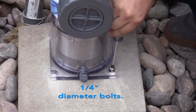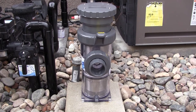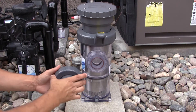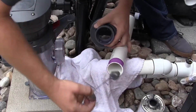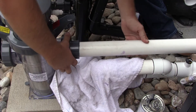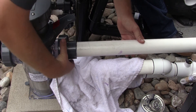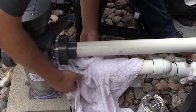The Hydro Right vessel comes with union nuts and tails pre-assembled on the housing. Remove the inlet and outlet nuts and note the orientation of the orange gaskets when removing union tails. After cutting pipe to length, glue the gray tail piece to the pipe end and repeat for the other pipe. Thread the union nuts onto the vessel and hand tighten both unions. Do not over-tighten — over-tightening will break the union nuts.